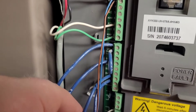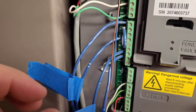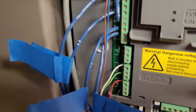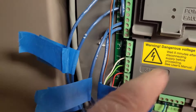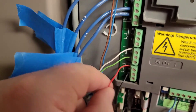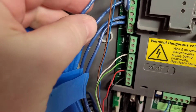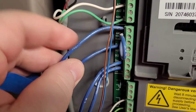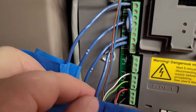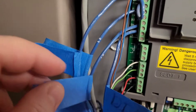We've got everything labeled. There are a couple of wires that, even though they are on this panel, they are not being used as part of the system. There is a constant speed terminal input here, but it goes to nothing inside the main panel, so that's something we can eliminate. Other than that, it's all pretty much straightforward. We do have the status wires here, we have the ready contacts here — by default, that's how these are set up — and of course our enables. These two wires here are going to be the main enable. We then do have an interlock as well as that constant speed, which is not used. I'm actually going to do a little more tracing on the interlock — I do not think that it's actually used on this as well, but that's something we will be determining.